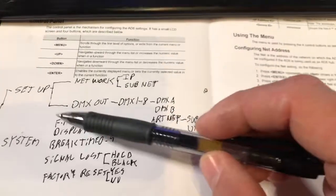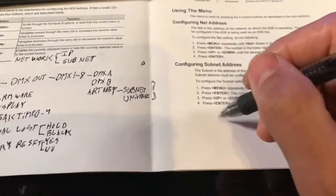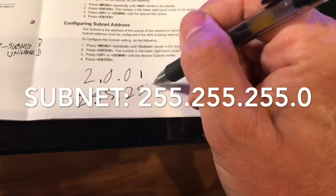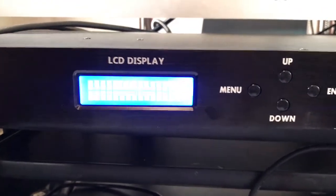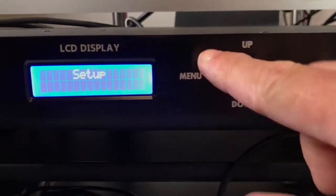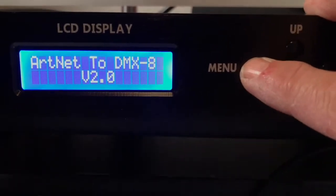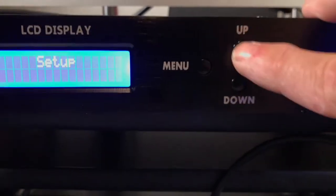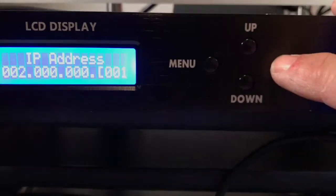Let me review what you need to do and then actually do it. When you get to the main menu, first go to Setup → Network → IP Address. Your IP address should be 2.0.0.1 and your subnet mask is 255.255.255.0. I don't totally know why this works — I did a bunch of googling and that combination works. Then you set it up on your computer and in the software, and once everything is plugged in it seems to work. Now I'll walk through the menu — click Menu four times and you get to Net. Let's hit Enter and we're at Setup.